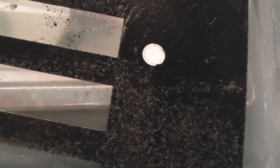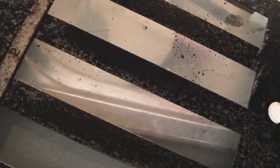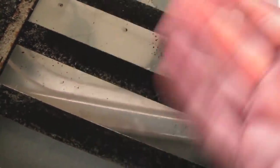So as you can see, I emptied the water here, and I used a paper towel and just wiped over it, and you can see it's pulled tons and tons of rust off now, but it's kind of black. What I'm not sure about is whether that's something to do with the carbon from the sodium carbonate, because I have read that sometimes when you do this with your rust removal, it ends up being black afterwards. But there's still a lot of rust there in places.